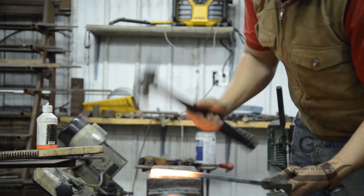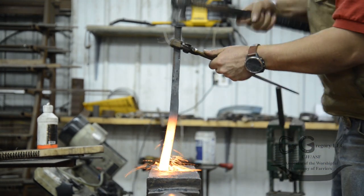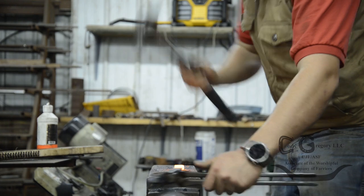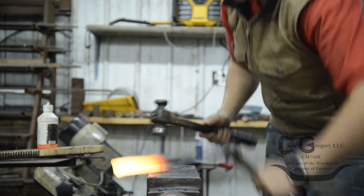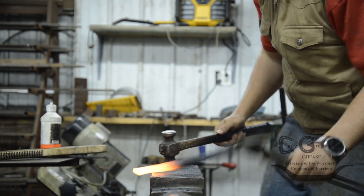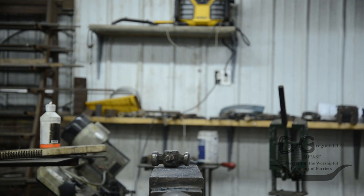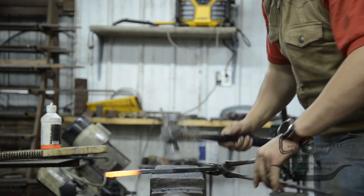When we go to fuller this shoe, we're not going to hang it up very much. We're going to let our fuller blow it wide and that will give us a little bit of extra width. I've got enough in my toe quarter, so I'm going to bump it down. Now we're going to bump from the center of our quarter down.